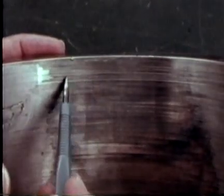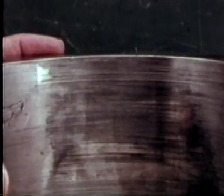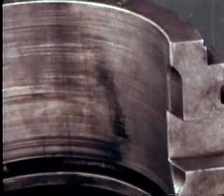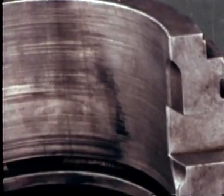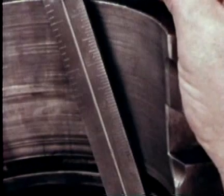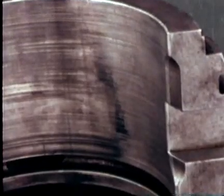Or, as in our case study bearing, the scratching is minor and normal. Misalignment is another damage mode caused by improper installation, faulty coupling with another shaft, or by thermal changes in the machine itself. Sometimes the pattern of wear on the bearing surface will lead you to the source of trouble. The wear will probably have a diagonal pattern if the bearing is misaligned with the shaft.